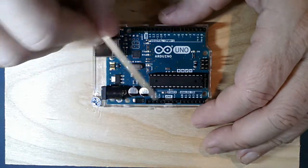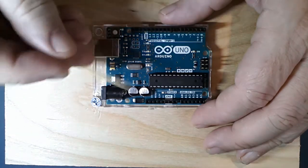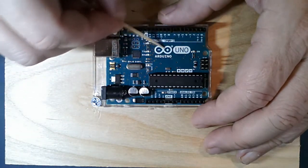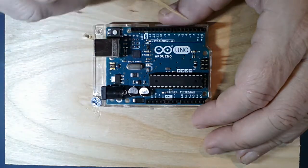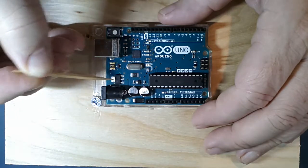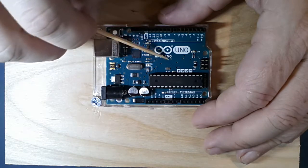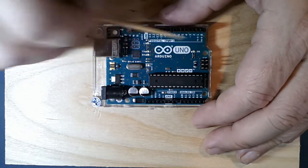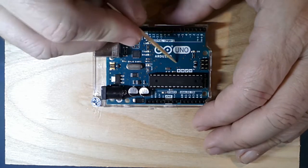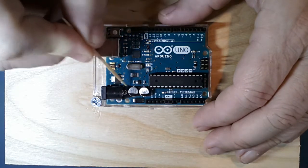The traces are made of copper, but covering this whole board is a material called solder mask. When they solder the board, they don't want solder sticking to all that other copper, so they put this coating on and it exposes only the areas where we want solder to stick. Everywhere else, if you drop solder on there it'll wash away - it won't stick to the board. That's why you see this bluish-green material over everything.